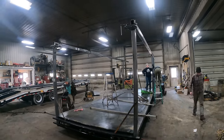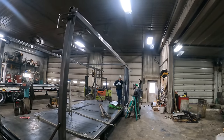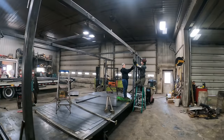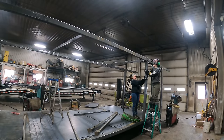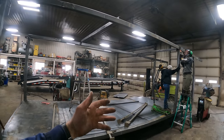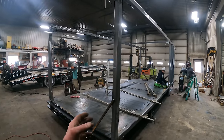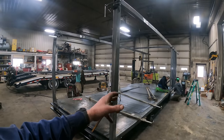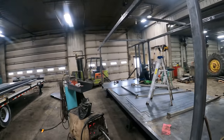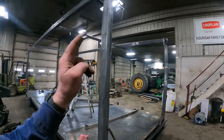All right, we've got all four posts up. We've got them all tied so they can't move either way, and we've got a couple of stiffeners across the top to keep everything where it needs to be. They're putting posts in on 24-inch centers. We could go as wide as probably three feet, but it works out better running at two feet because we're using four-foot sheet metal, and this body is 22 feet long — so no oddball gaps.